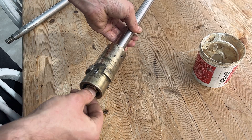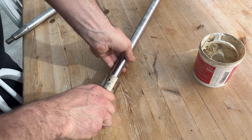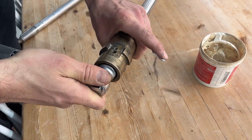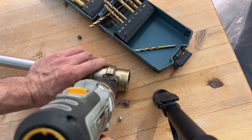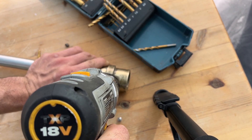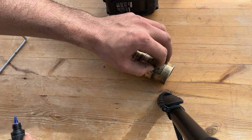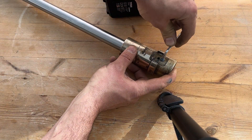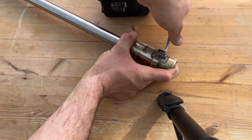Check the description and manual for torque settings — mine was 57 Newton meters. You'll need a very large engineering vice to hold the hub while you torque it down, as it's pretty high. I had to re-drill out the shaft nut recesses for the Allen key locking bolts as they didn't quite align on the new drive shaft. Add Loctite to the Allen key locking bolts, tighten them firmly for a snug fit, and wipe away any excess.